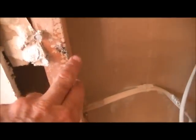And that's basically it. Okay, we are about an hour or hour and a half later and the tear out is done. Tear outs go relatively quickly. My worst fear was recognized in that these were plaster walls. Usually pre-90s is going to be the lathing and the plaster. This probably weighed a good 500 to 800 pounds — you can tell where the old lathing was on these nails.